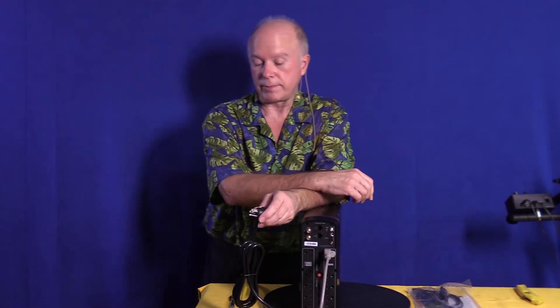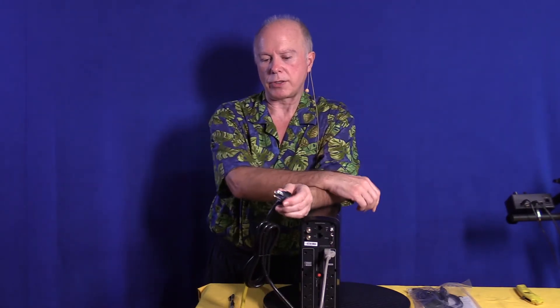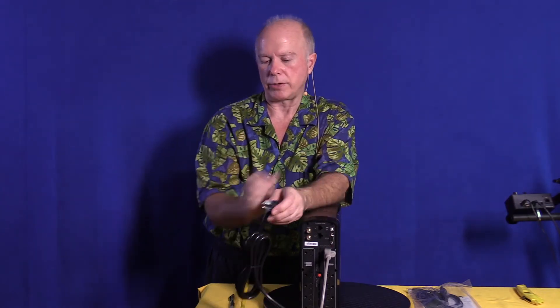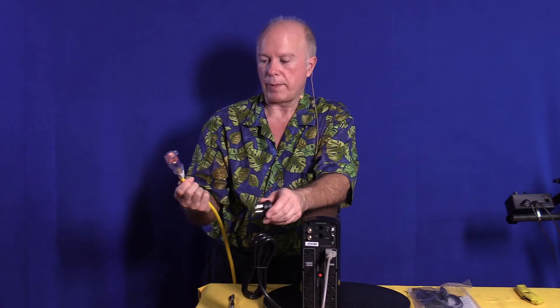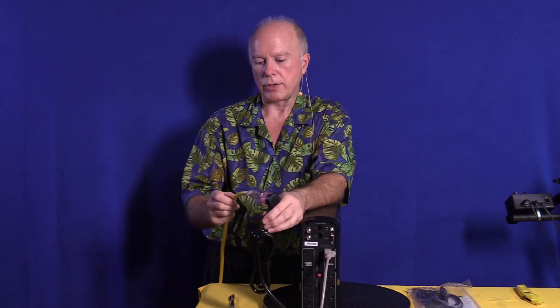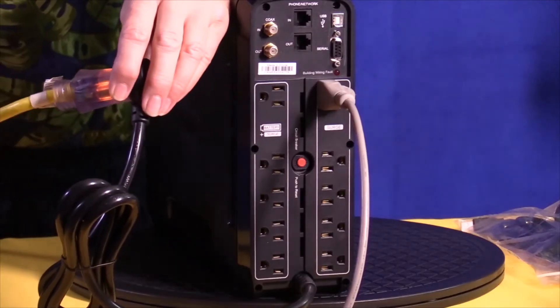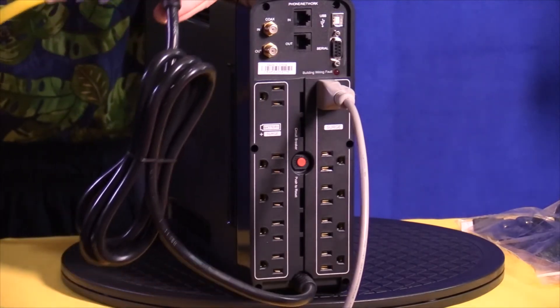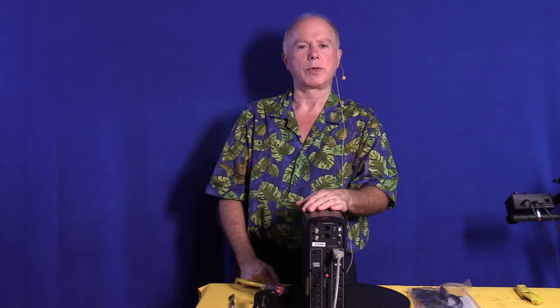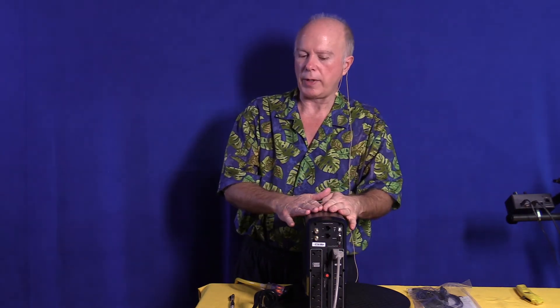This is kind of do what I say and not what I do. First of all, a UPS should be plugged straight into the electrical outlet — not into a power strip. A power strip may or may not have a surge protector in it, but it could cause the UPS to malfunction. If for some reason you cannot plug straight to power — we're an example of that — we use an extension cord. I like to use extension cords that have LED lights in them so I can tell if I've got signal. I use the heaviest extension cord I can get for 15 amp.